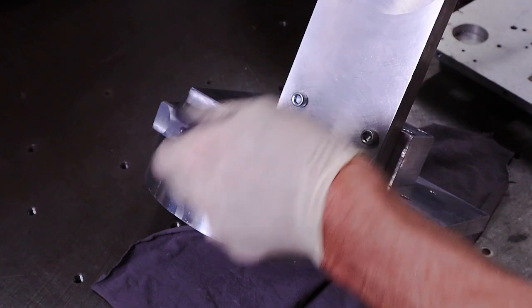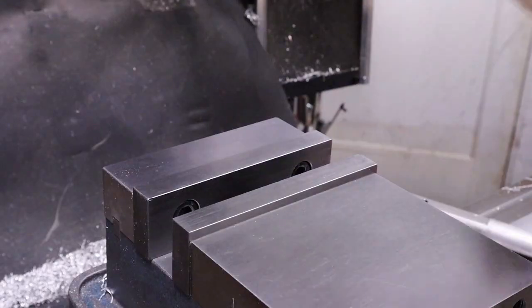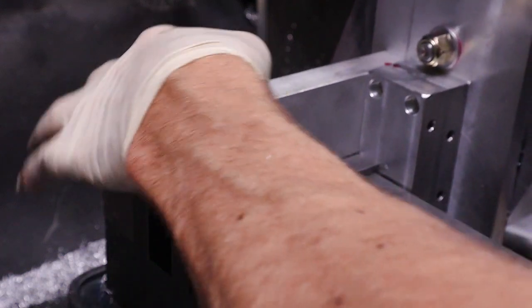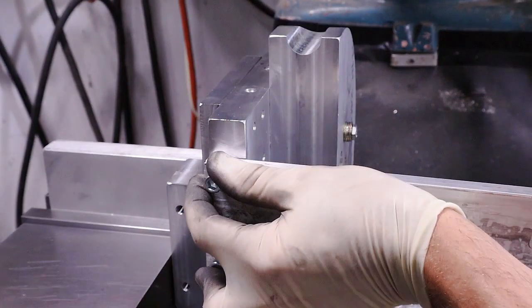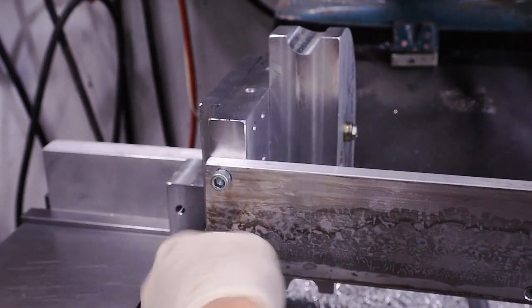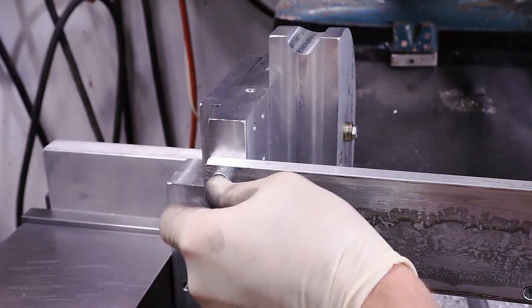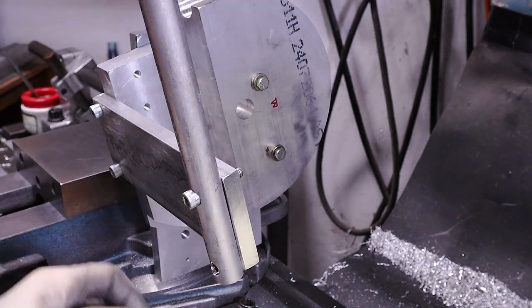I just cut the tube profile for the die. I will need to mount the rotary table in the vise at 90 degrees. To do this I will bolt a longer block on the bottom of the table to stick in the vise. I also have to move the lever handle off to the side so it will clear the mill head when rotating vertically.